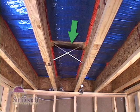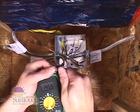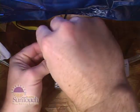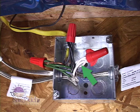Note the gap left on both sides of any obstruction. Once all the mats are installed, perform another resistance check of your white and black wires with your ohmmeter. Connect the power leads in parallel with the Romex cable. All the green wires join together with the bare ground wire. All the white wires from the mats join together with the white load wire. All the black wires from the mats join together with the black load wire.